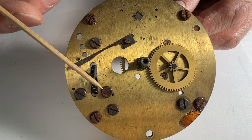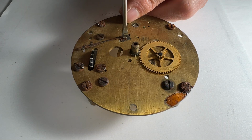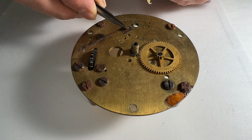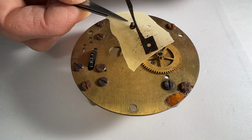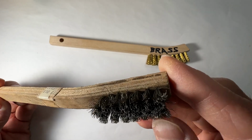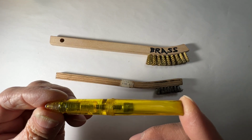For the restoration of this 1943 Chelsea deck clock, lots of rust on the front plate will need to be dealt with. This masking tape will help trap some of the loose rust on these parts. Helps keep the work area clean. I'll need to clean several screw slots before they can be removed from the movement. Brushes work good for mechanical removal of rust.